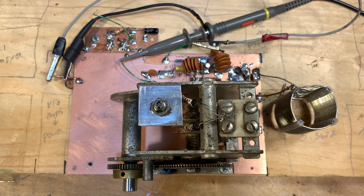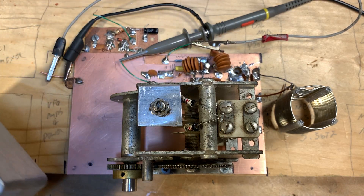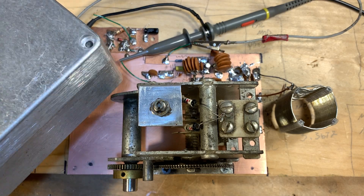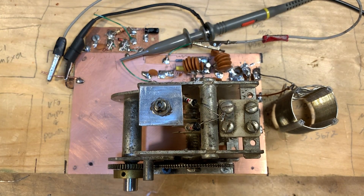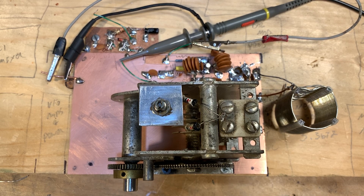I don't have this thing enclosed — no box or anything. It's just sitting on the workbench with air currents, the heat coming on and off. But over a long period of time, this thing is really stable. It moves maybe 10 Hertz over a 24-hour period. That makes me wonder whether I need to go to the trouble of putting it in a box. Frank Harris K0IYE and Mike WU2D recommended a hermetically sealed die-cast box — I got one — but I'm kind of inclined to just leave it the way it is, since I've already mapped out the territory on the board for the rest of the 17/12 project circuitry.